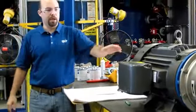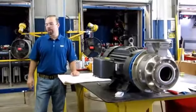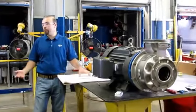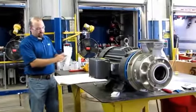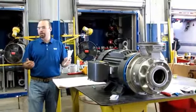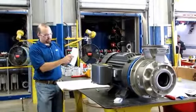We've got some that just came back from a facility where the motor shaft was damaged, and the motor shop wants $3,000 for a repair on a $5,000 motor — you may as well buy a new motor. So the sleeve is kind of a sacrificial element. If the seal goes haywire and gets damaged, it's going to damage the sleeve before it damages the motor shaft, and that way at least you can replace just an inexpensive sleeve.